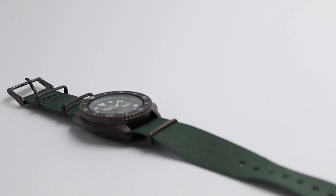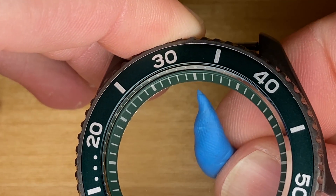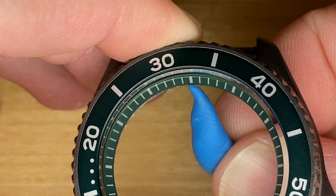If there were any downsides to this watch they wouldn't be related to the actual technical aspects. One is that it's not uncommon for them to be delivered from the factory not terribly well regulated — being off by 20 seconds is unfortunately not uncommon, but it's a quick, easy adjustment by a watchmaker and they can be made to run quite precisely. The other issue is the notorious chapter ring, which can be off in its alignment from the dial because the alignment hole is much bigger than the peg that aligns it, so it can shift to one side or the other. It's kind of the luck of the draw, though I was able to drop the movement out from the movement side and move it to greatly improve the alignment so it doesn't bother me when I look down at the watch.